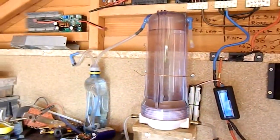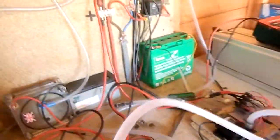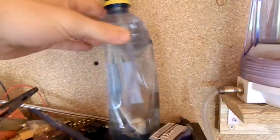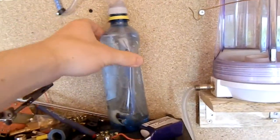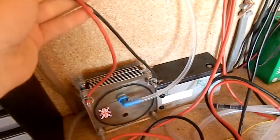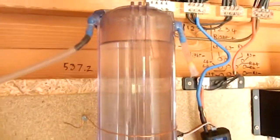This is a hydrogen generator which I just use for soldering very large connectors — the sorts you may see on the ends of these 8 gauge wires. It makes it really easy. The hydrogen seems to recombine or something, because after a few days of sitting the bottle seems to collapse in on itself, though it doesn't seem to do it explosively — I've never heard a noise from it. It pulls about 20 amps and then goes up to 25 amps once it's at full temperature. It doesn't get too hot and it's just potassium hydroxide and water.